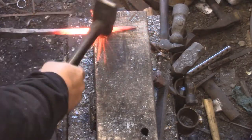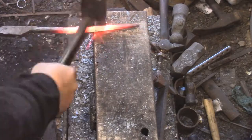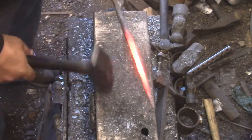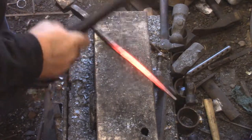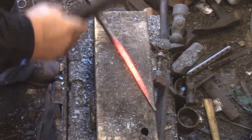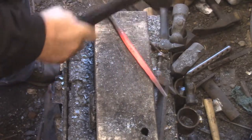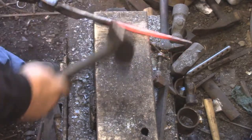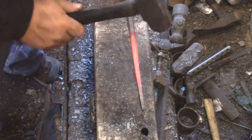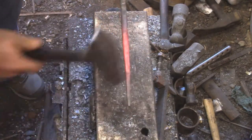The problem is, we didn't heat the block when we welded it. So the welds were pretty brittle. What they were was, it's like they went into the steel block there, but they solidified before becoming one with that steel block. And eventually, after 6 months, it just kind of fell off. I had to pry it off. It was coming off slowly.